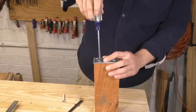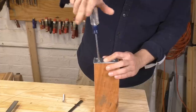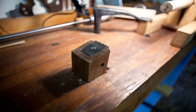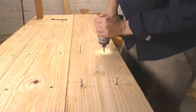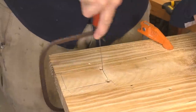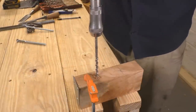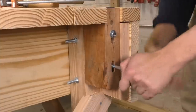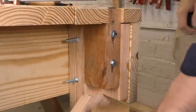If you want to build this stop, I have all my viceless work holding solutions in a single affordable set of plans — there's a link in the description. Historically these stops were mortised into the benchtop, but my joiner's bench is kind of small and I don't have the real estate for that. Luckily I've worked out a mounting method that works perfectly. First I'll pull the closest board off the benchtop and saw out a notch that fits the post of my stop, then drill some closely spaced mounting holes and clear the waste with a chisel. The post can then be lag bolted to the leg of the bench and come right up through that notch in the top.